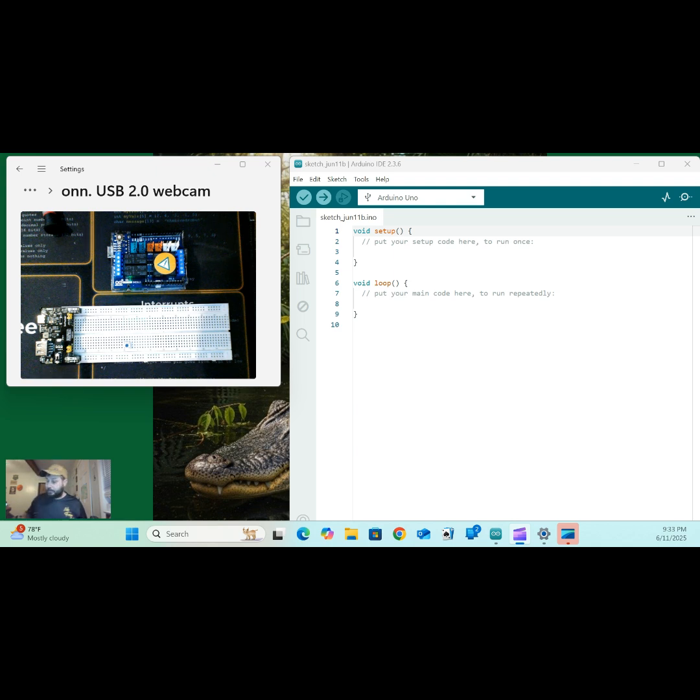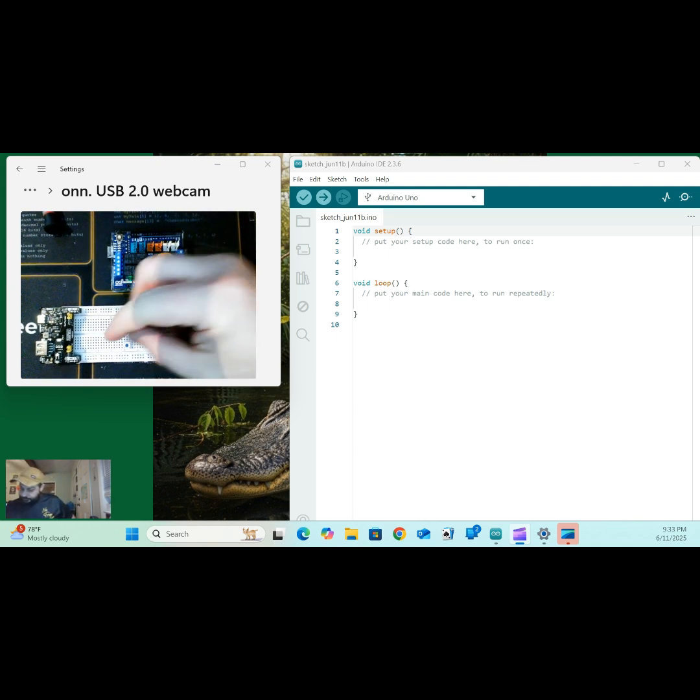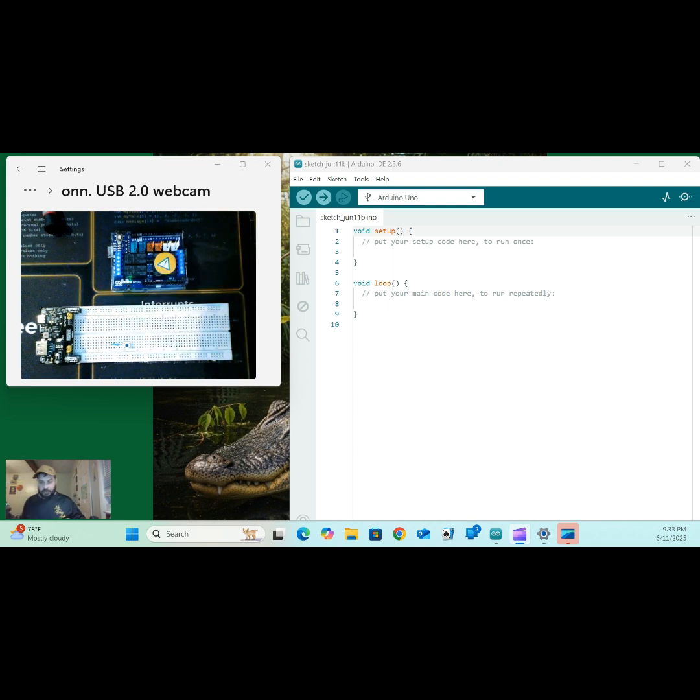Let's change that. We have our 10K resistor. This is going to be our pull-up resistor. We're going to put it from one leg of the button to another column. Now, if you remember correctly, these right here go to our digital pins, okay? The one that's closest to the relay is the ground. That pin goes to digital pin 6, and that is 5 volts power, okay?